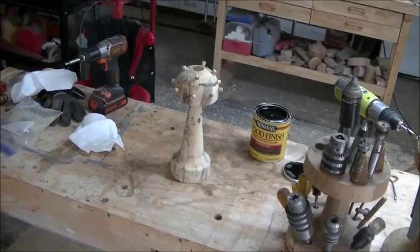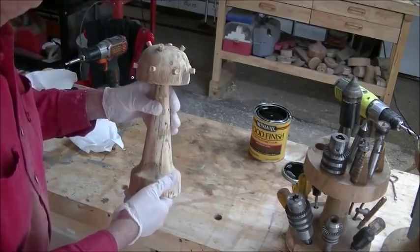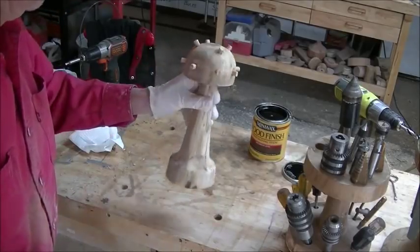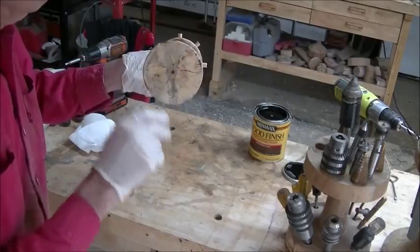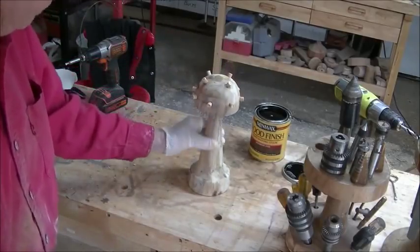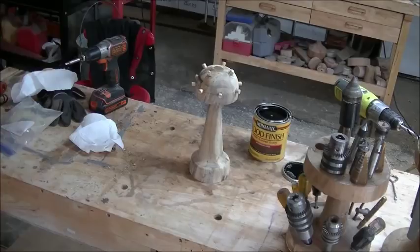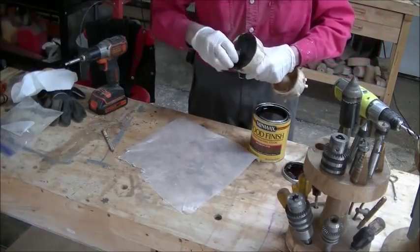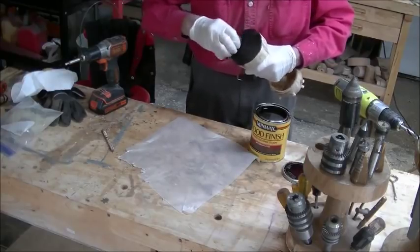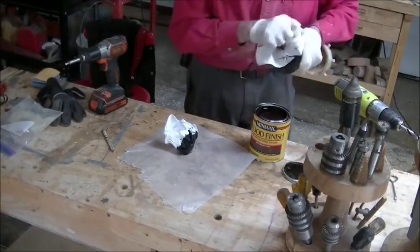Here's what it looks like before staining. I took some 3-inch dowel pins, drilled holes, used medium CA, put them in and sanded them down. Put a little brass disc right here to cover where that drive center was. Sort of looks like a porcupine mushroom. My wife doesn't like white wood, so we're going to make it dark wood. Here's this Jacobean stain — let's see what this is going to look like. Almost black — soaks right in as you can see.